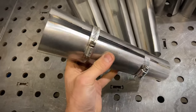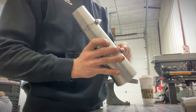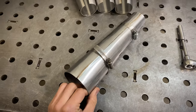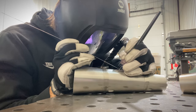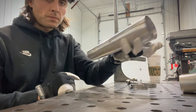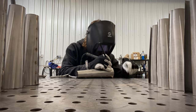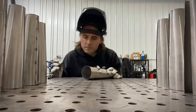For the tacking process, I just like to use basic hose clamps — two of them. Tighten them down, bring your seams together. This is not rocket science, but hose clamps work pretty good. Pull that seam together, get it nice and tight. Our seam is pulled together — pretty basic. I'll usually put about three tacks on with the hose clamps, then take the clamps off and put a few more on. A tack every inch to inch-and-a-half is more than sufficient. Grab a cone, put the clamps on, pull the seam together, get a couple tacks in place — then grab the next one and tack it up. If you need a little hammer work, bring it over to the tube and do some hammering on the seam.